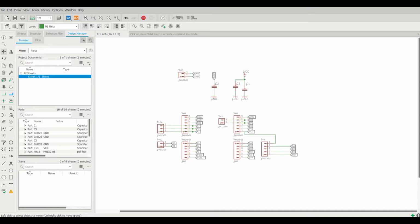We won't need the expansion chip, so this should be a fairly simple PCB to make this time, and it'll probably be pretty useful for things like Arctic lorries, where you might just have the one drive motor, or any sort of basic tractor really. But the TC118 is not the only motor driver I have here to test, so we'll make up the general board, and then I'll just change the chip on the different boards so that we can try out all these different chips directly in a model. I'm not sure what the model will be, maybe a couple of different models, but we'll have the different boards so that we're able to test out the different chips.